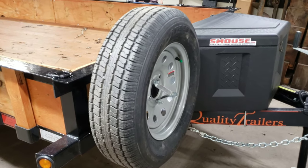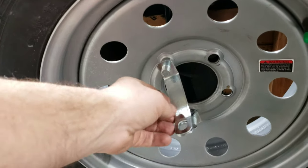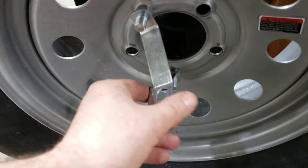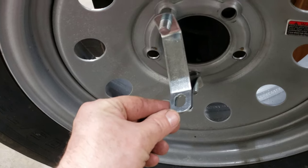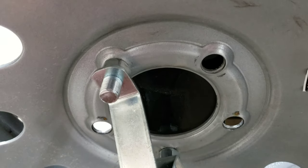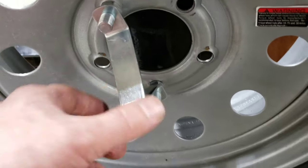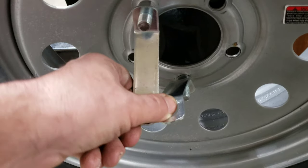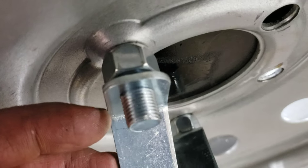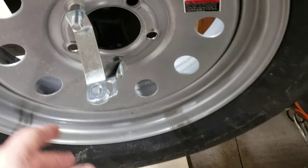Looking at the front side — what they give you is a lock mechanism. These are threaded straps of steel, so they thread onto your stud. You put your acorn nut on, thread these on, and if you choose — I'm not going to use them, I have them on just for presentation — you could put a padlock through here so nobody could get a socket in and steal your spare rim and tire. It's cheap, it's easy, and it'll get the job done. To take them off, you simply spin them off and they unthread right there. It's a simple concept, one you could reproduce on your own.